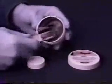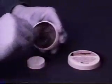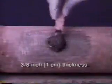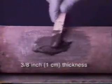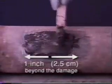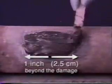Be sure to scrape all sides of the cup. Mix until there are no streaks of black or white. Mix vigorously — the two-part resin will harden quickly. As soon as the paste is mixed, apply to the leak. The sealant should be applied generously to a thickness of three-eighths inch (one centimeter). It should extend one inch (two and a half centimeters) beyond the edge of the damage.